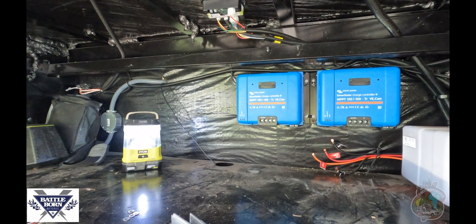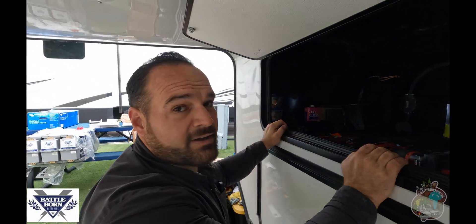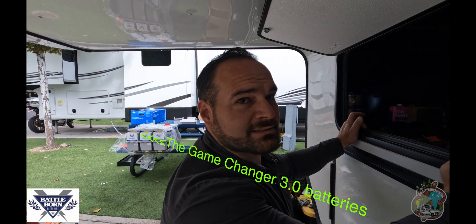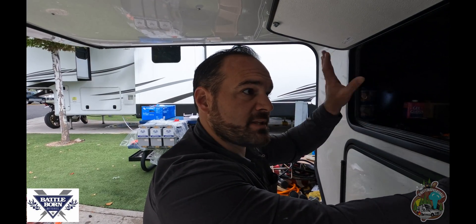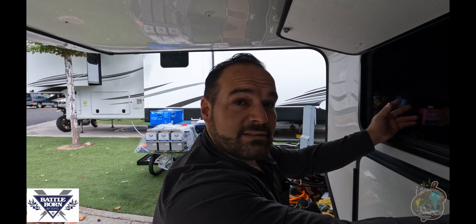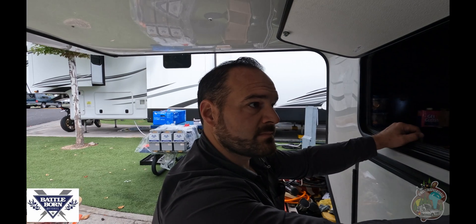Steve, why do I have these really cool Victron Energy 150 by 100 controllers? They look good in that bay, but why are they there? They're there to turn the sun's power into free energy. The RV came with a little itty bitty one that was just running my one single battery. Since I'm going to have over 2,200 watts on the roof, I need two to split those. We could get away with one if we were using one type of panel, but since my RV came with two 320-watt panels, we're going to leave those up there and add three 405-watt panels. They have to be separated because wattages and voltages don't match — when you wire solar, you have to keep things similar. We'll be about 85% of the available power of the charge controller once you add two more to the existing system.